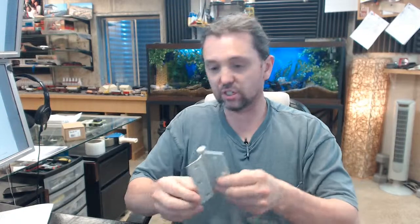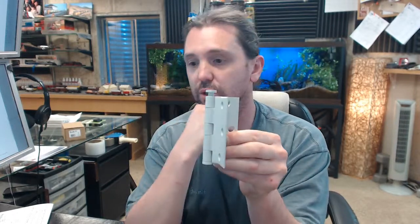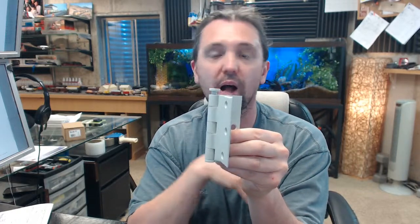Okay, now let's go over the description of this. Because it's plain bearing, 3.5-inch size, it's for medium weight, low frequency doors, normally used on composite core doors with hollow metal frames. Composite meaning a solid core wood door, or a wood door with some sort of core, because the 1 3/8 thick metal doors are relatively uncommon.